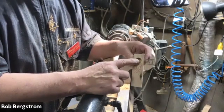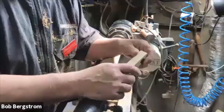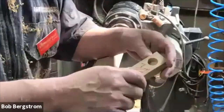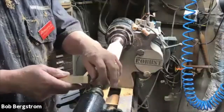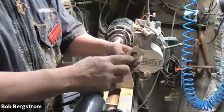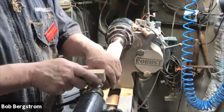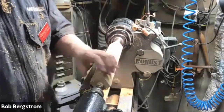This is a drilled out 3/4 inch hole, and it's my go/no-go gauge when I'm doing this. And then I can just take this off, measure to make sure I have that tenon the right size. Just drill it out with the same bit you just drilled in the disc, and that will give you a way of just taking the back end off here and sticking this on it. You could do it with the plate, but it's a little more cumbersome.